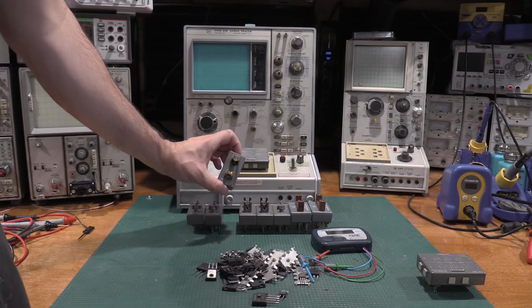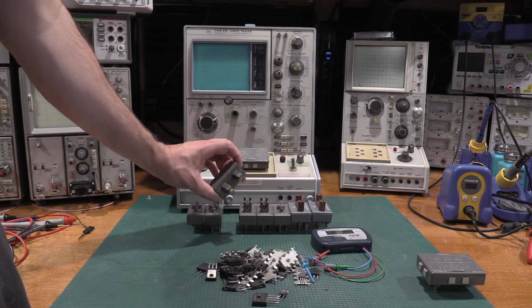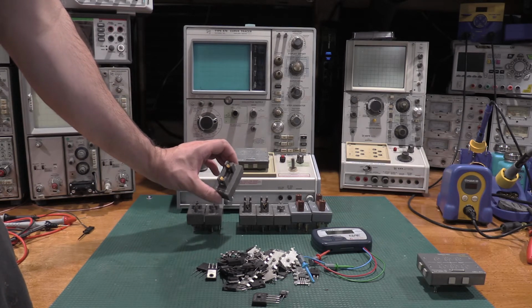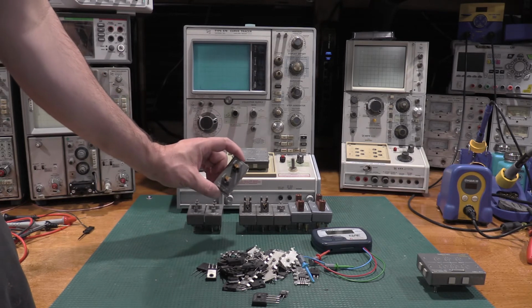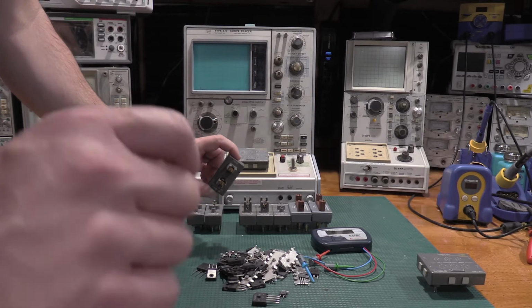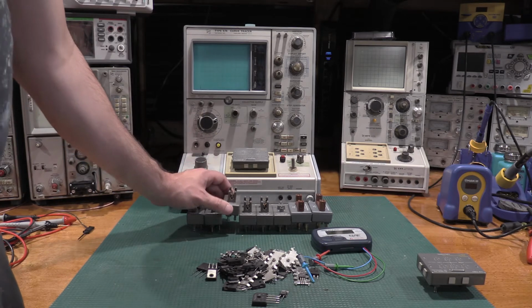These are very useful. These are generic two-terminal devices. They're labeled diodes, but you can put resistors and everything in there. So these are good. The ones not to get these confused with are the ones that say stud diode. If it says stud diode, their spacing is different. It wouldn't be good for standard two-terminal devices, so that's something to watch out for.